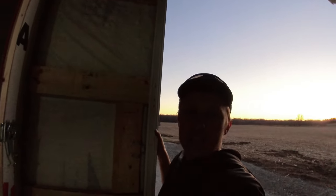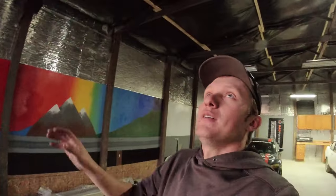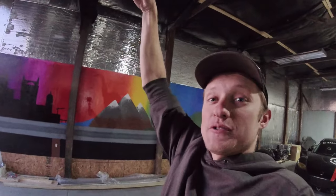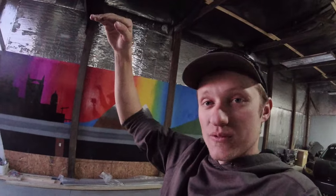With the insulation done, let's talk about the walls and my big sliding door. You might ask why a sliding door — sliding doors don't seal that well, which is true, but the accessibility of this building was important to me. If I had multiple spaces I could have put a smaller door, but I might work on the bulldozer in here, or need to pull the 1466 in here with a cab and pop the duals off. The bottom of these rafters to the concrete floor is 12 feet 3 inches; this door is 12 feet tall by 12 feet wide. With the rafters as short as they were I could not get a 12-foot overhead door without modifying the trusses.